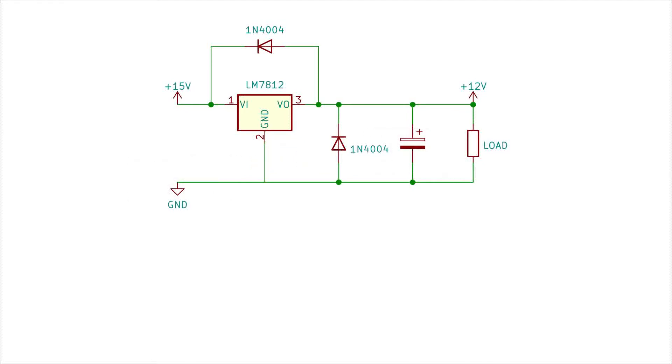However, there is no such capacitor in either of these power supplies — there's always some parasitic capacitance, but it's pretty small and I don't think it can cause this kind of trouble. The application note says the pin 3 to pin 1 diode isn't needed if the capacitor is less than about 10 microfarads, and parasitic capacitance is way less than that. My feeling is that the diode from pin 3 to pin 2 is superfluous, though I'm not certain it's causing any harm, so let's leave it in.